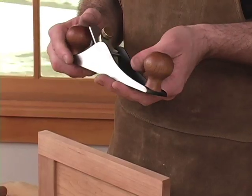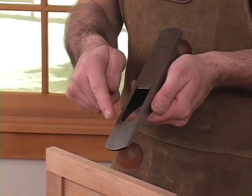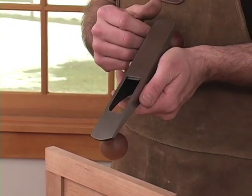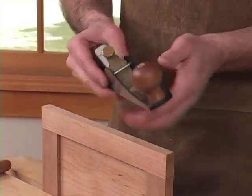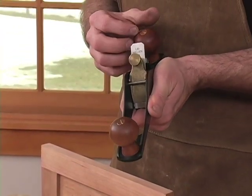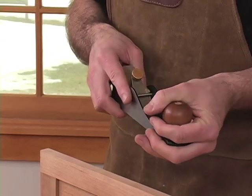Let's go over the components of the tool. This is a plane for heavy removal. It has a wide open throat to allow the shavings to clear easily, but also gives an open view of the work area as you're taking your cuts. There are two knobs that allow for a firm grip and control of the tool.